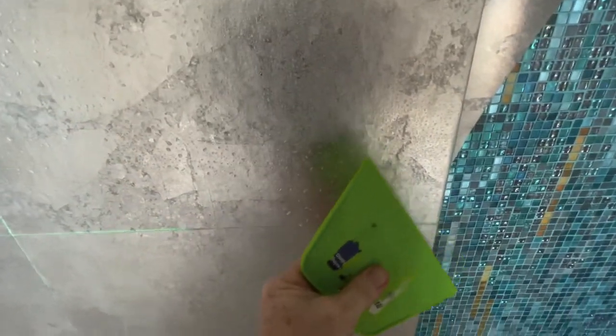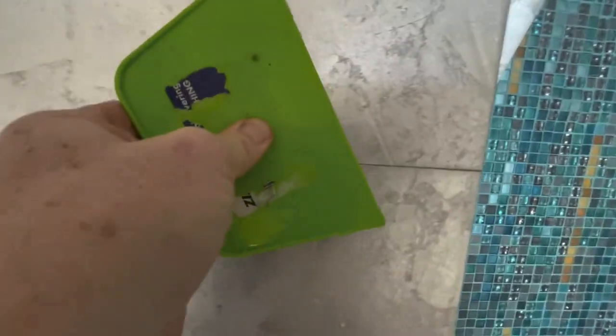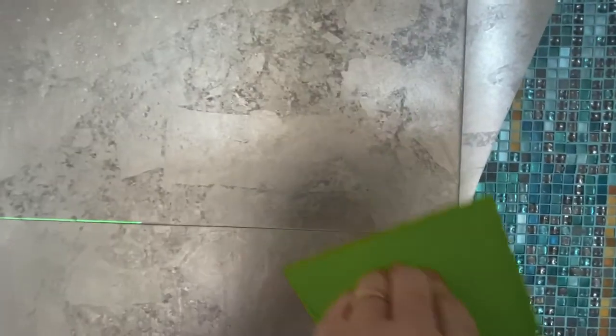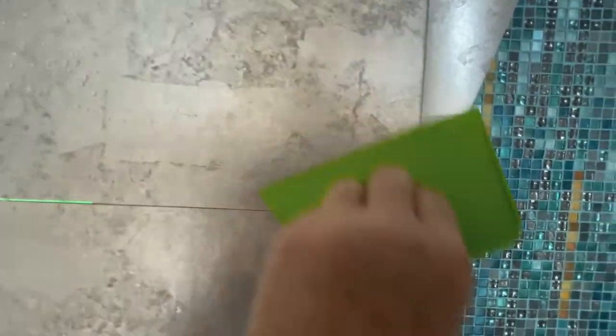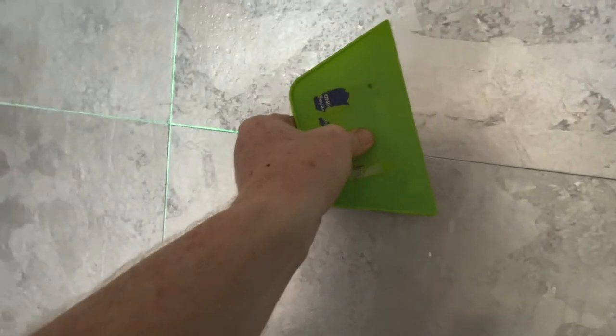Let me take you up close. I'm not cleaning this, I'm just lubricating it because I don't want to be making marks on the wall covering. Now it's loosely installed here, it's loose. And now just take a note of the manner in which I press on the wall covering. Look at this. See the dent I just made? You don't want this to be your first rodeo. Okay, light. Press harder, harder, harder. Gradually press. Now I'm going toward the corner on a vertical angle.